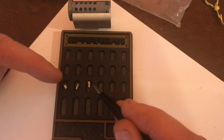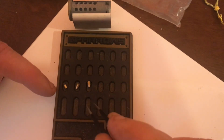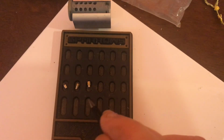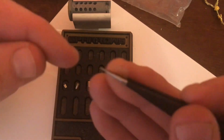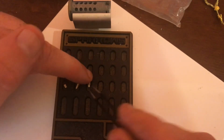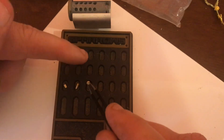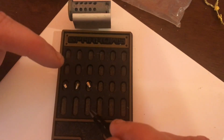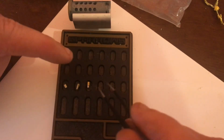And the other thing, like any reduced diameter, you want to be a little bit careful with the key pin that you pair it up with. So if you're reducing the diameter on the key pin as well on the top of it, they can do what the spiky pins do, where they kind of can crank in beside each other a little bit and jam up, and you want to avoid that. So very often what I'll do, especially if I'm feeling a little bit lazy and don't want to keep experimenting with it, I'll just pair them up with a standard key pin. That way it's going to push in right across it nice and smoothly.